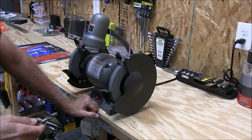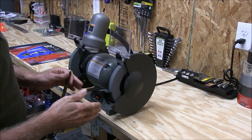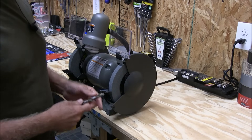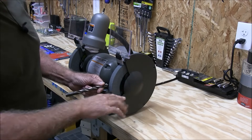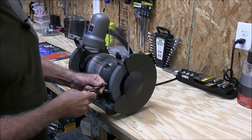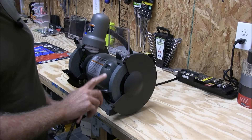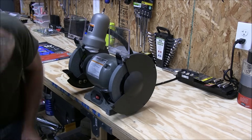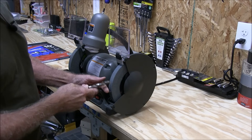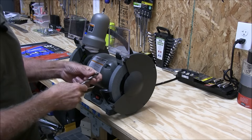In order to understand how to sharpen a drill, you have to understand some basic geometry. What I do is imagine an imaginary line right in the middle of this grinding wheel — it splits it into two halves. The key thing is to stay above the center of the wheel. We have a rest here and it's about center. We're not talking precision here, but it's about center.